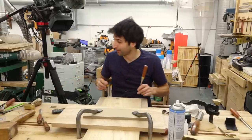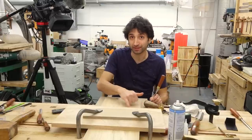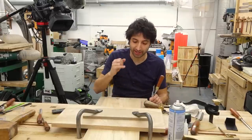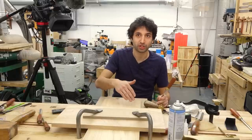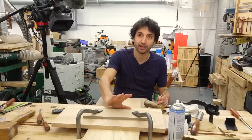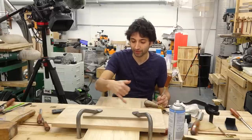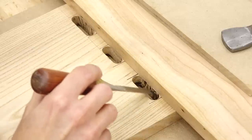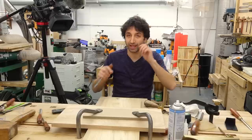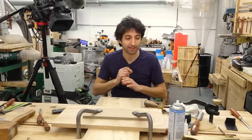One thing that I will share or note: I used a half inch bit to cut this half inch mortise, and using it with just a reference edge like that, it does give a little bit of chatter on the side opposite of the fence. So my cuts aren't actually perfect up in here. It's a little bit jagged and there's a little bit of walking here and there. So the edge of my mortise isn't perfectly crisp, or it's not quite as clean as it could be.